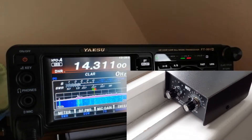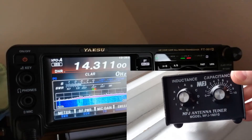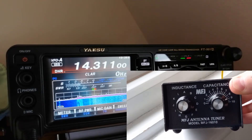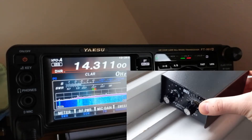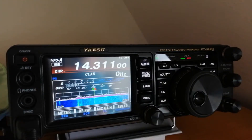It's a good idea if you can make a note — grab pen and paper and make a note of the current settings. So this is roughly H for inductance and capacitance is 9. Just put 20 meter, hyphen H, hyphen 9. Now you know when you want to operate on 20 meters, you can just do H-9 and you'll be roughly there.